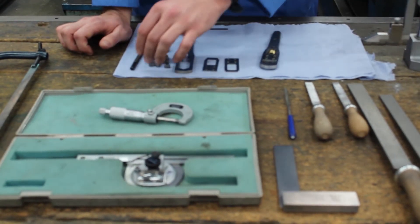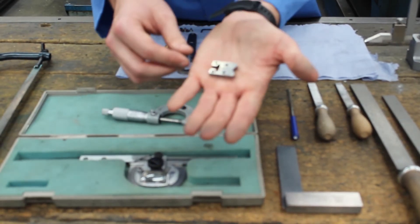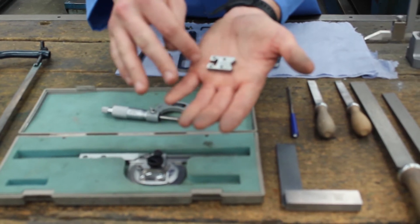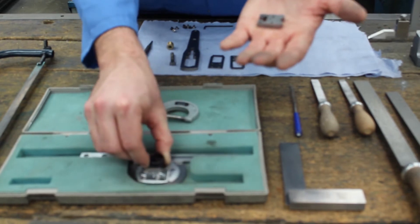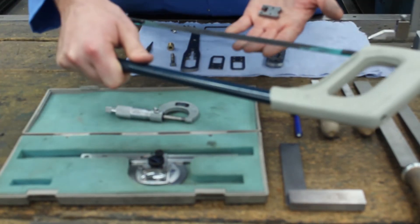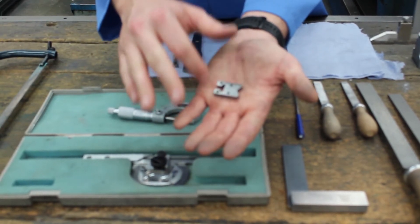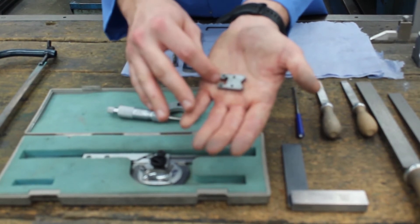For the assignment we have to make an adjustable spanner. The first stage of making the adjustable spanner is the jaw. Simply, we are going to cut the mild steel to length and use engineer blue and a vernier protractor to mark out the angles. We are then going to cut the angles using a hacksaw. After that we are going to drill and tap the four M4 holes and then drill and file out the T-bolt slot inside.